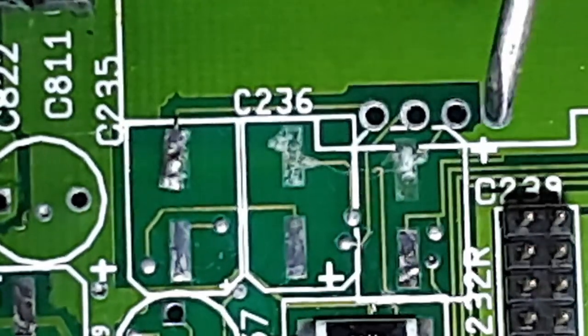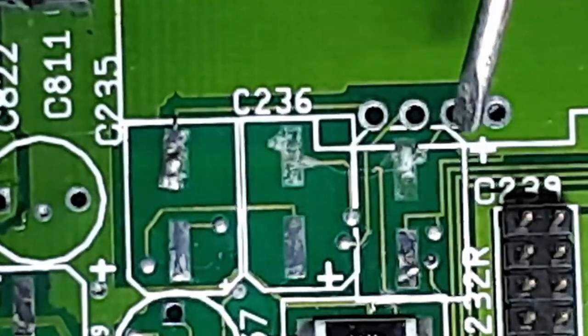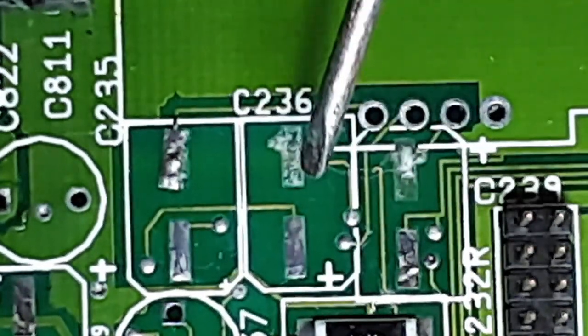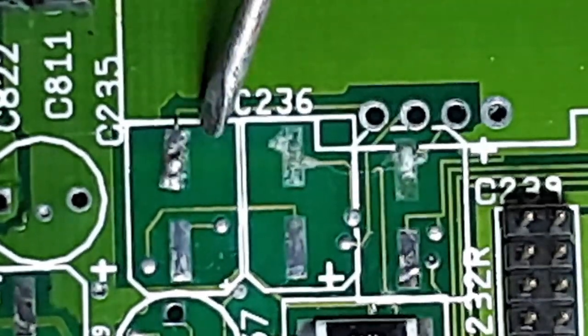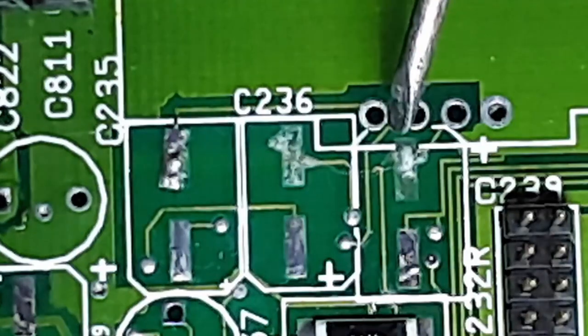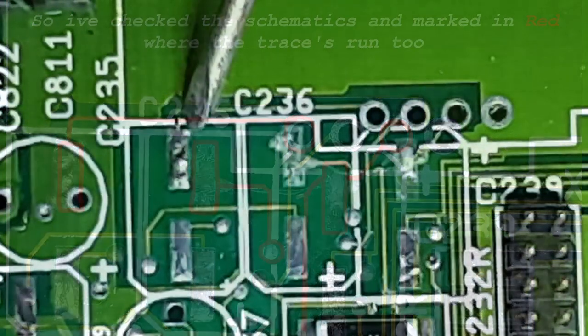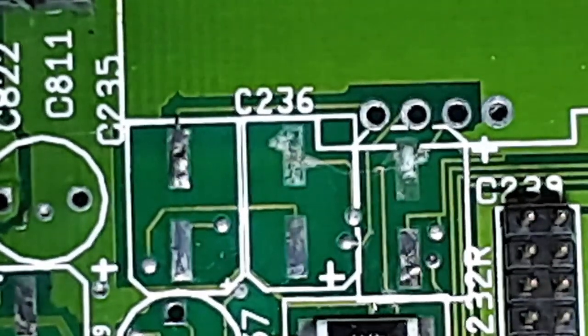So what I'm going to have to do is repair that connection there to that pad, and repair that connection up here down to that pad, and run a wire in from there down to this pad, and we're going to run a tight little wire up there and right across the back side of there to this pad. So that's what I'm going to do to repair them three pads on there. As you can see, it's very wobbly, is that one. I'm going to try and glue it down, but I don't think it's going to stick that. It's only held on by that little tiny little bit of trace you can see over there over the white silk screening. So it's going to be quite difficult, that.